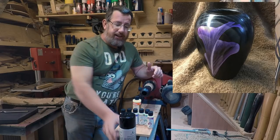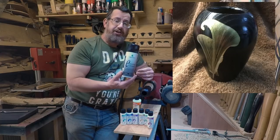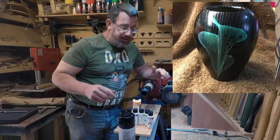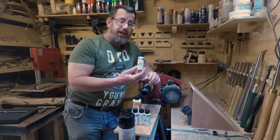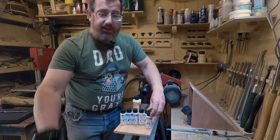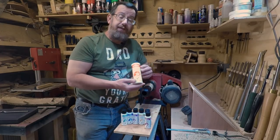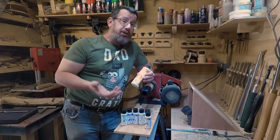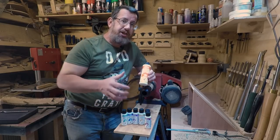Now, Wayne actually used a piece of ash, and he used the chestnut ebonizer and lacquer on there, which dries fairly quickly. For his colours, he was using the Jo Sonja's iridescent paints, which I have now gone off and bought the entire range. Because they're a fairly thick paint, you need to also get the flow medium, which basically waters them down and thins them out. You can use water, but it can be rather unpredictable, whereas something like this dilutes the paints properly.